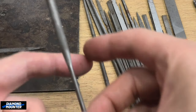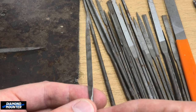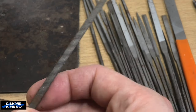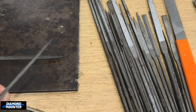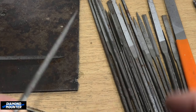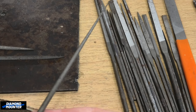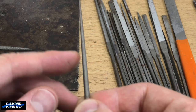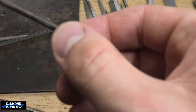You can buy these in a pack - a fold-out sort of plastic pack - but even one of those packs is going to have more than you need. It's nice to collect exactly what you want, and you can get the highest quality - it might actually be cheaper. Tri-square: yes. Half round: reluctantly yes - don't need them that often but sometimes that curvature is very useful. Round: yes, you need those. They do seem to wear out quickly compared to other files, probably due to the curvature putting a lot of weight on a very small surface area.